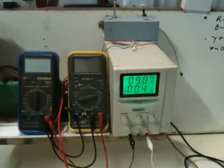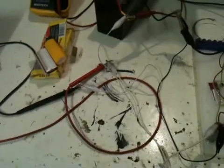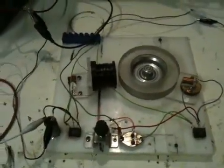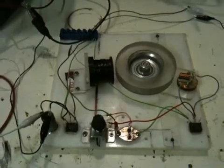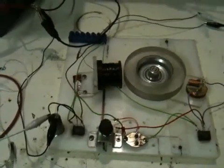So 9 volts, 40mA going into the system. I've tried to set the wires out so you can see clearly how it's working. It is set up as on the drawing I put on a previous video, except for the coil — it's got an extra 150 turns on top of the 450 I suggested to use. And of course nothing hidden underneath making the motor run.